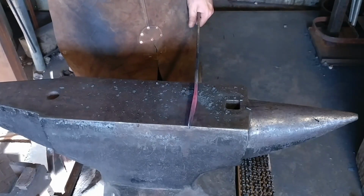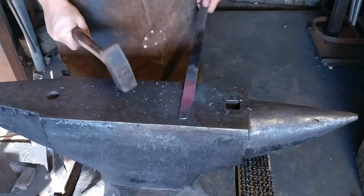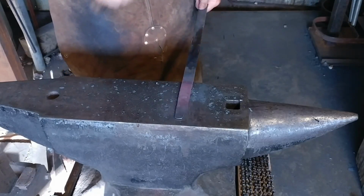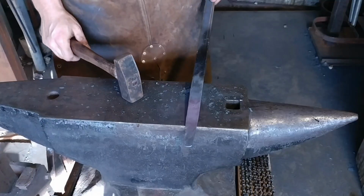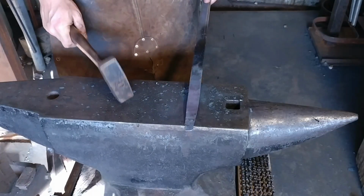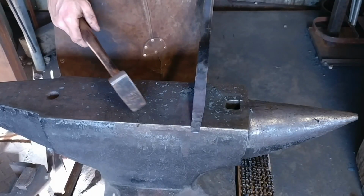And then we're going to make it extra rough here in just a second, using the nice crisp edge of my anvil. I am going to put some little groove marks in it. And that should be right about now. There we go. Just moving it progressively, trying to strike the piece and not the anvil. And we're just leaving some lines all the way across it.